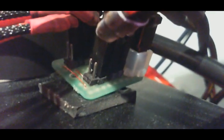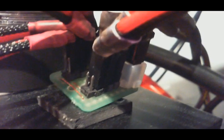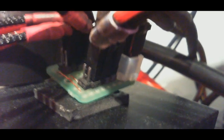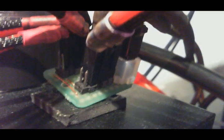I also designed and built my own LED controller. This is powered by a 4-pin Molex. As you can see, it's not that professional. It's unglued. I have to find better tape. All shrink wrap, double shrink wrap, heat shrink on the wire, so the sleeving won't pull out. So I got a shrink tube underneath the sleeving and on top of it. So there's no way in hell that the sleeving's going to separate.